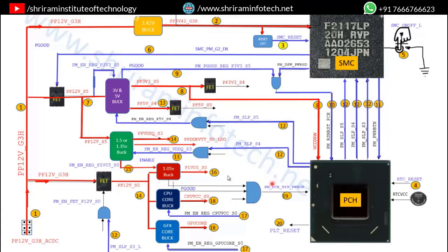Another AND gate checks all inputs to verify that all power good signals are present. If all power goods — from each supply — are present, the AND gate generates the final PCH_SYS_PWROK signal.